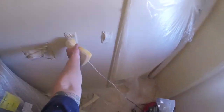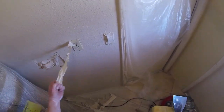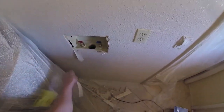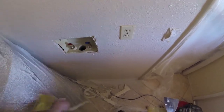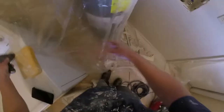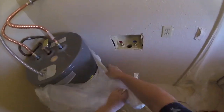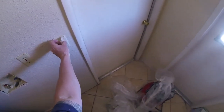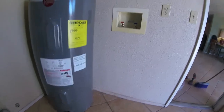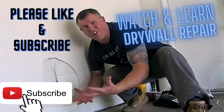Once it's all textured up, go ahead and clean up your work area, pull your plastic. Always pull your masking when you're done texturing. Let your work area dry — don't speed-dry it with a fan or heat, as that can sometimes cause cracking. With joint compounds, it's better to let them dry on their own. 24 hours is always a rule of thumb. Once he gets it painted up, he can put his washing machine back — and that's a good repair for a simple patch job around a plumbing pipe. Please comment, like, subscribe, and watch my other videos. Thanks for viewing.